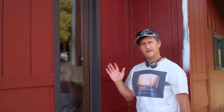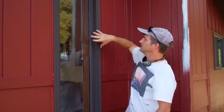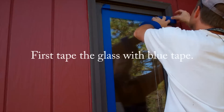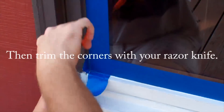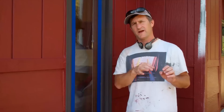Now if you have any wooden windows, you're going to have to paint them. The way I paint a window is similar to how I did that door trim — you start on the inside and move toward the outside. Do this whole leg, then the top leg, then this leg, then the bottom leg. I like to get it on really thick down on the windowsill. If you have the kind of windows that need window putty and that putty is cracked and failing, see the video on my website about replacing cracked and failing window putty. See how the bristles just barely hang over the edge?